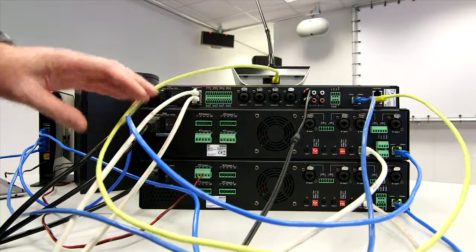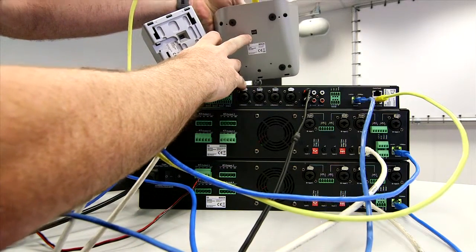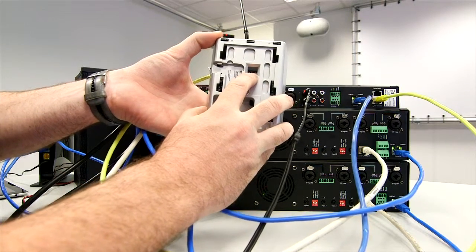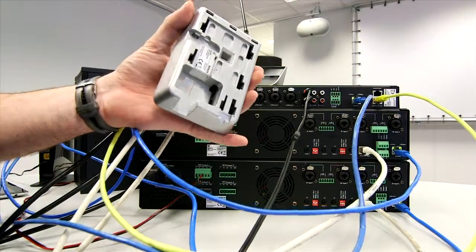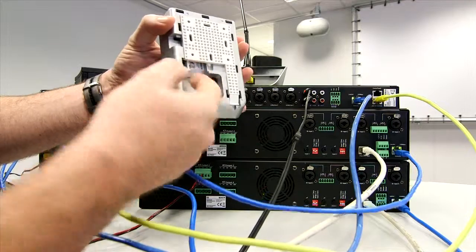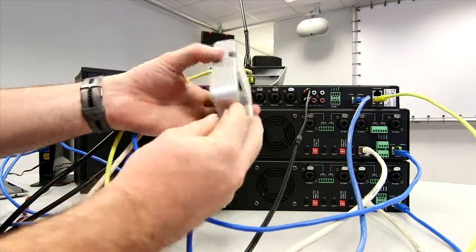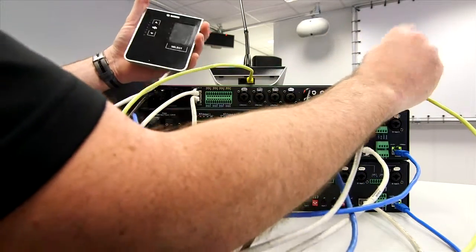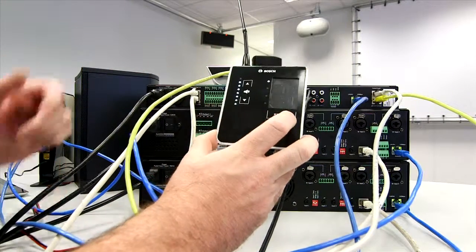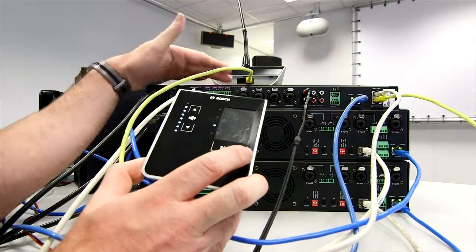The wall panels are connected on the rear of the unit. Both the call station and the wall panels have user IDs set at the bottom of the unit. You can set the user ID with a dip switch prior to powering up. We simply set the dip switches within this area, then connect this part to the wall — slide in, pull down, click it on. The RJ45 connectors are down below; you can run them in from up top or from behind the wall. Capacitive touch again. When we connect into this unit from the rear, we connect to the control panel, and we see that the unit is powered up. You can daisy chain onwards from that point — select, toggle, all the good stuff. Now you have connected inputs into the system.